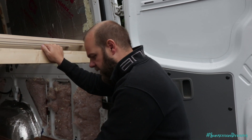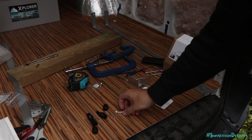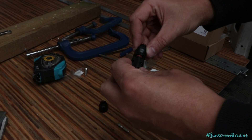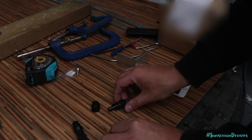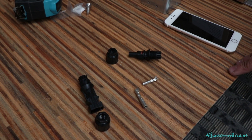The first thing we need to do is join the two solar panels together, and for that we're going to be using one of these MC4 connectors. An MC4 connector is a connection where these two pieces clip together, meaning you can easily disconnect them. We'll be adding these onto the positive and negative from each solar panel and then clipping those together. So let's get up on the roof of the van and do that.